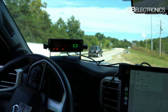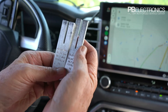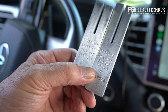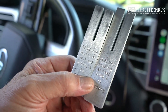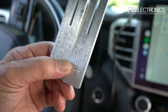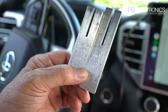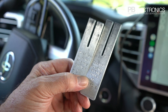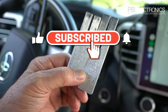The reason for that is: one fork is 25 and one is 40. The 25 mile an hour fork is your patrol speed, and if a car was closing in on you at 40 — which is your high fork — the radar takes the closing speed and subtracts the patrol speed, giving you a target speed of 15. That's why in moving mode, when you use a 25 and a 40, your radar will read 25 in patrol and 15 in target — the 15 being the 40 mile an hour closing speed minus the 25 mile an hour patrol speed.